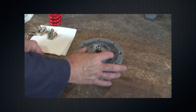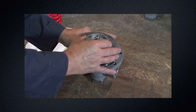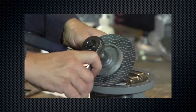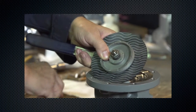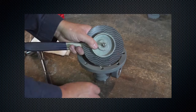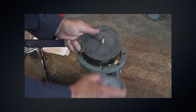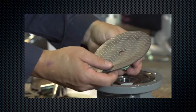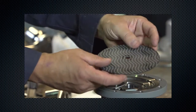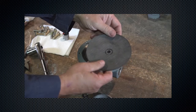For type MR98 units, remove the diaphragm assembly. Remove the lock nut and remove diaphragm parts from the post. Inspect the diaphragm for rips, cuts, tears, and other damage.